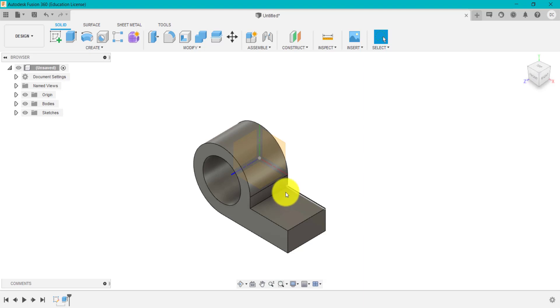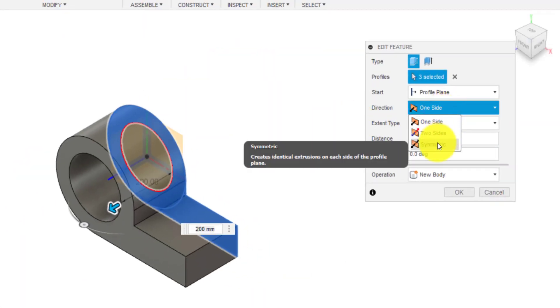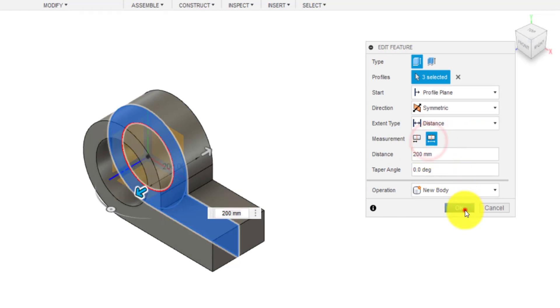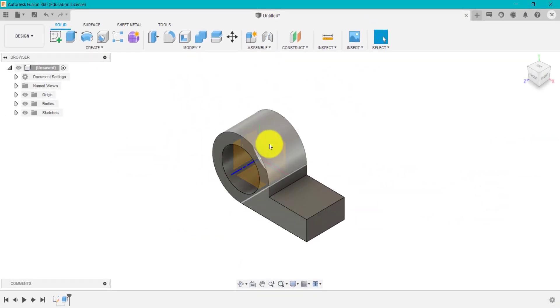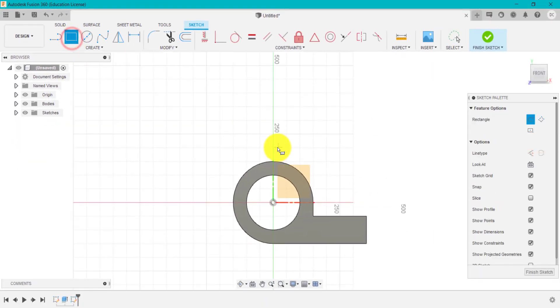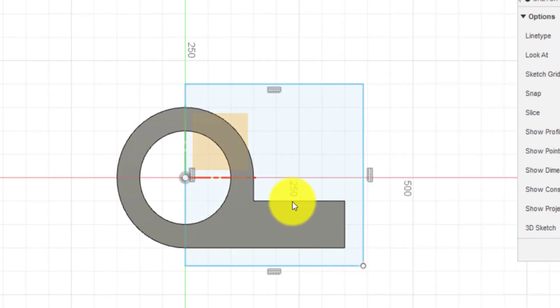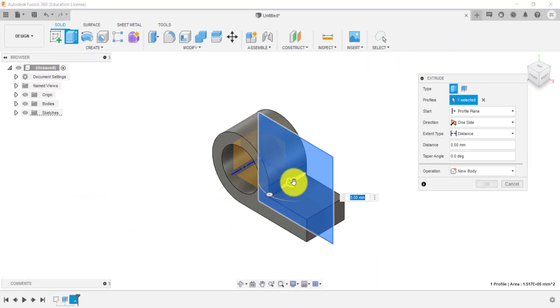I'm going to create a sketch — actually I'm going to go back into here, go to edit feature and with the options, I'm going to go symmetry. I'll make sure that my planes are running through the middle. I'm going to create a sketch here and use a center or corner rectangle tool to drag this out. Don't worry too much about the dimensions because I've got it snapped in the center. So I'm going to use E for extrude, drag and remove this, and click OK.